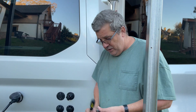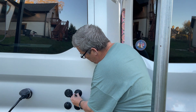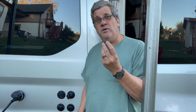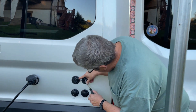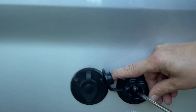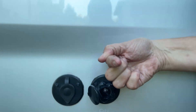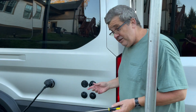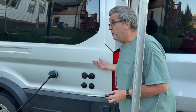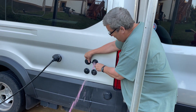It's because of this little screen right here which is inside here. If you pry the screen out, you can see the little valve inside — that little white valve — and it's pushed under pressure this way. My water pump is turned on. All you do is just take a screwdriver and press it in.